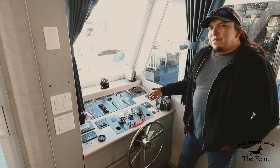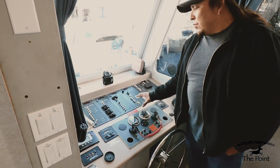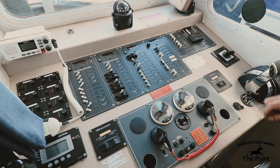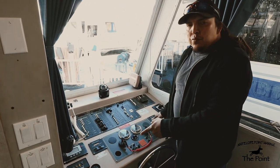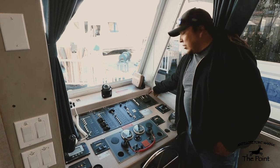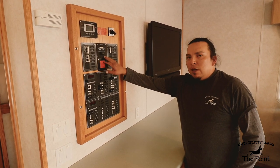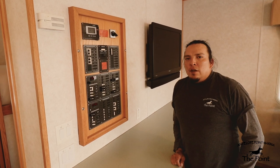I want to show you a slightly different configuration at this helm. The panel board is mostly the same — you have your DC panel, AC panel, shore power switches, and generator switches. The starting procedures are the same. The only thing we ask is to use one generator at a time. If you are switching between generators, notice that you have a generator one and a generator two switch, and only one can be activated at any time. If the generator doesn't start or starts but you don't have power, we need to walk to the engine compartment to make checks.